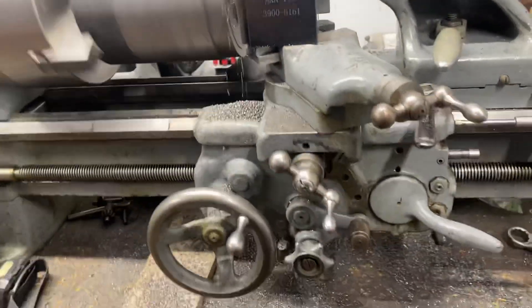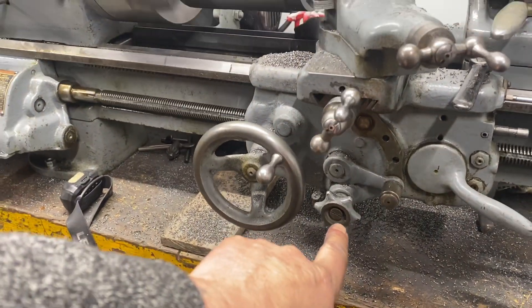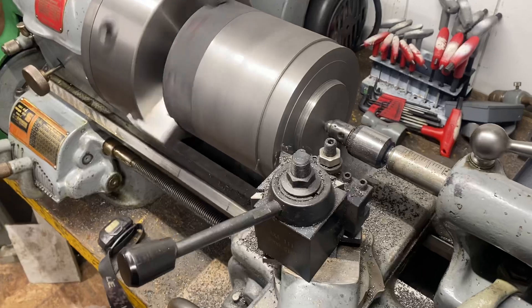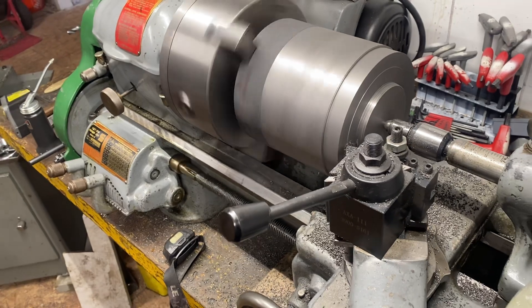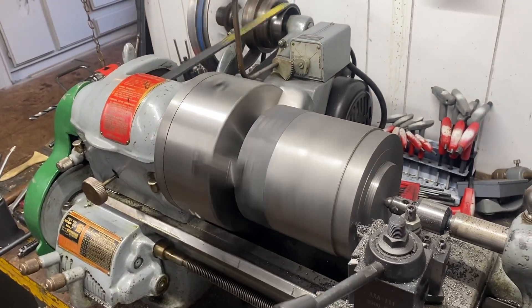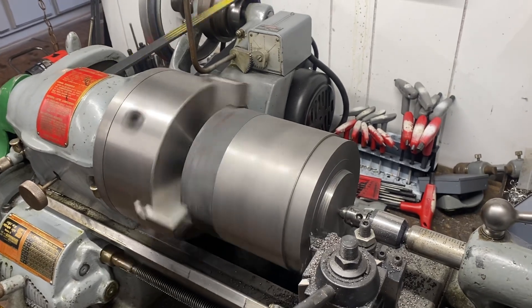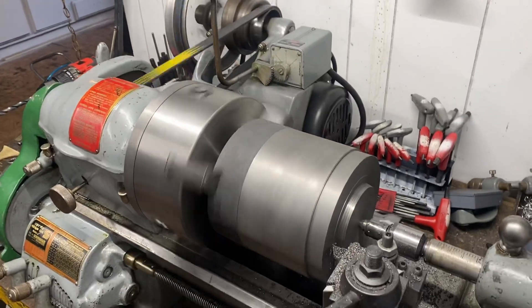When I first bought this machine I thought I would prefer a lever over the star drive, but now that I'm used to the star drive I actually do like that clutch setup. It's really nice because when it gets to where that shoulder is, it'll actually shut itself off automatically — it won't crash the machine, it actually cuts off. I've been keeping an eye on it and stopping it myself, but yeah, once it gets in there it'll turn itself off.